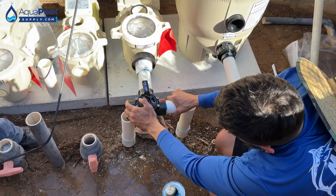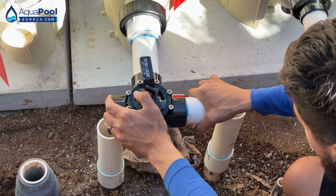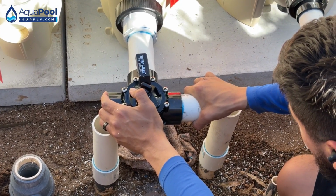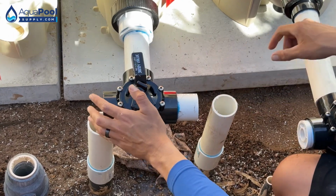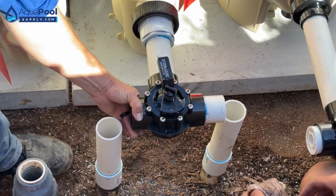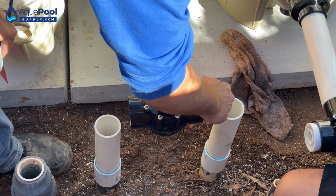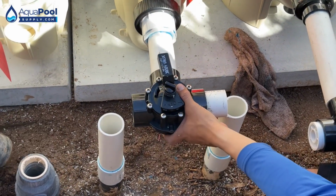Oh yeah, you can see it pushes out. Especially when you're going into the valves and unions. When you're going into pipe into 90, pipe into coupler, it doesn't seem to kick back as much. Yeah. But when you go into valves and stuff like that, it really does kick back a lot harder. Cut right at the T. So right on the line of the T.